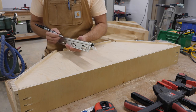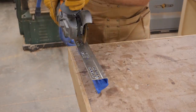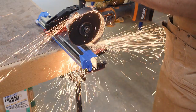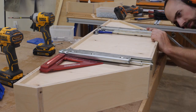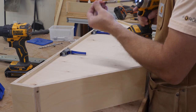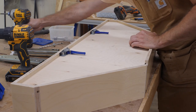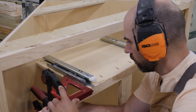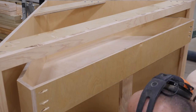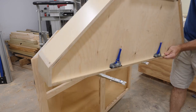Okay so this is where things get a little Frankenstein-y. Undermount drawer slides are typically installed on the sides of the drawer box, but since this is a triangular cabinet that wasn't an option. I went to town trimming and cutting the slides with the angle grinder. With all the modifications finished I drill the locating holes in the back of the drawer box and lay the slides in place. I use a square to make sure the slide is perpendicular to the front of the drawer box, mark the location of the front clip, and then screw the clips into place. I lay out where the slides will mount inside the cabinet, clamp a square in place to register the slide against, space the slides back from the face frame per the manufacturer's instructions, and screw into place. Now I just lay the drawer box onto the slides, click it into place, and check for functionality. There's a little shake when the drawer closes but this goes away once the cabinet is installed.